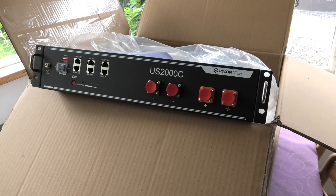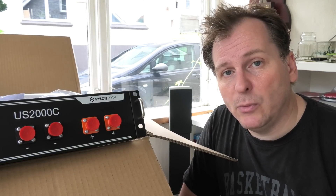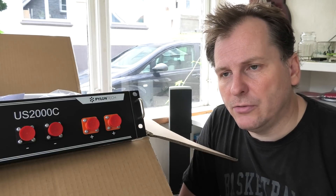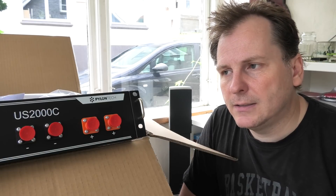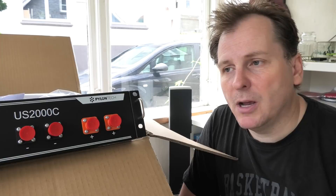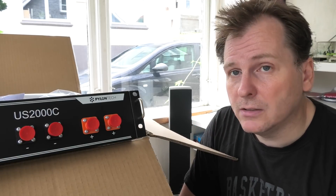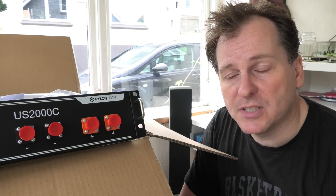It's a dreadful task getting rid of those lead-acid batteries. They did really well for a couple of years, but I failed to notice the voltage was very low, and right after that there was no solar power for three months. I bought a charger for them but it was too late, then I bought the balancers — also too late. Just have to bite the sour apple and get on with it. It's irritating, but those new Pylontech batteries look great too.